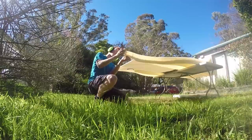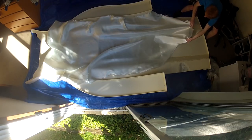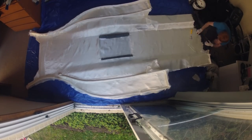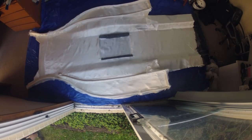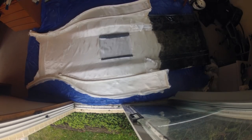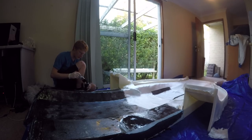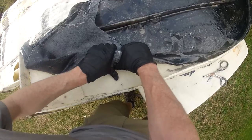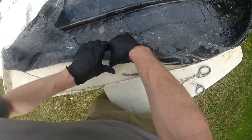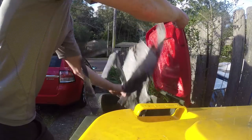I took it outside to clean up the edges ready for fiberglassing. I started with sandpaper and a chisel but quickly lost patience and got the grinder out. Once clean I brought it back inside on a drop sheet ready to be fiberglassed, and pre-cut all of the fiberglass to limit how much I'd need to do once the epoxy was out. Now here is where I made a big error in judgment. I assumed I'd be able to wet out the fiberglass mat on top of the foam core, so I didn't apply any epoxy directly to the foam before laying the fiberglass on top. I applied the epoxy over the top of the fiberglass assuming it would soak through — it just didn't bond to the foam very well at all, meaning I ended up having to tear it all off and start again. Doing the entire top surface in one go also meant I wasn't able to get the mat positioned very well, so it was pulling too tight or too loose in some areas leaving bubbles and voids.